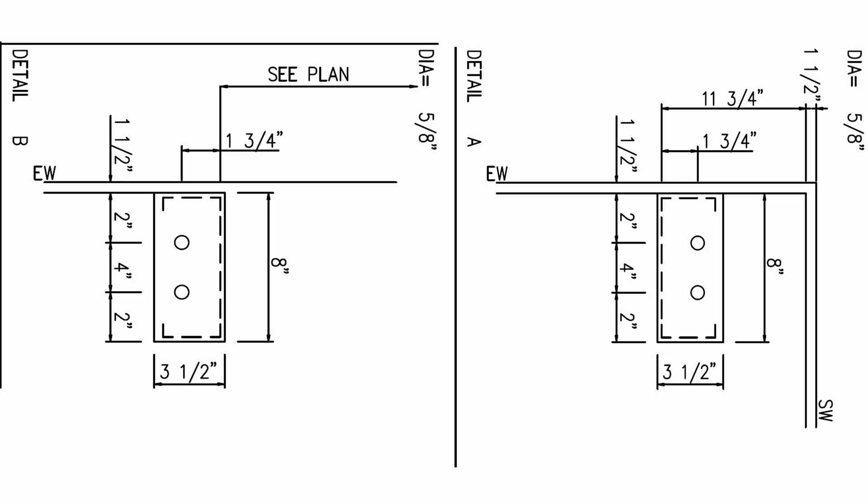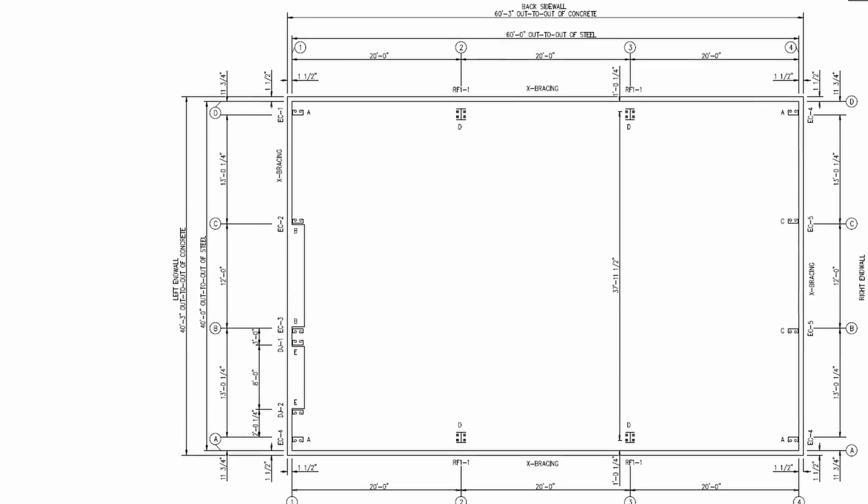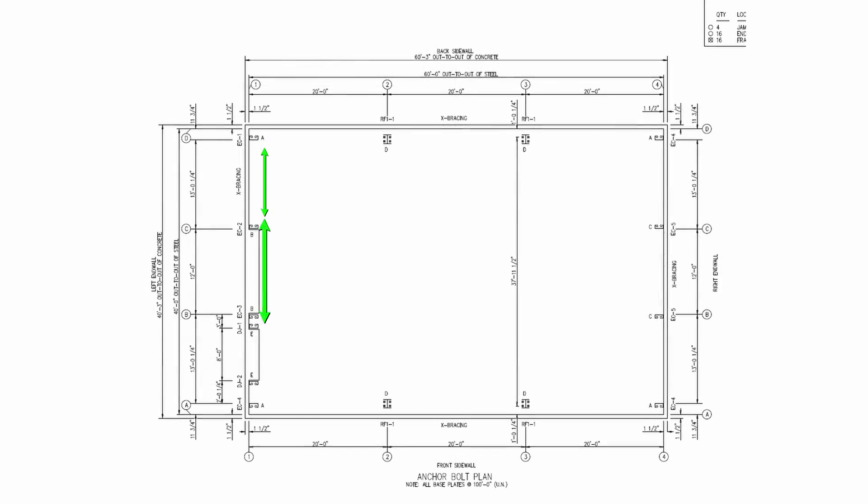C-channels either face inwards or outwards — we call it toeing in or toeing out — and the bolts are generally one and three-quarters inches from the web, the tall part of the C. Knowing the slab was the correct width, this measurement was easy. We still cross-checked from the other sidewall and did it on the opposite end wall as well. If the end wall's length is not within tolerance — say it's 40 foot 2 inches or 40 foot 1 inch — check the measurements between each column or each set of bolts. If the wall is out of tolerance, the method is to check dimensions between the patterns or bolts and decide on corrective action. This is some tough math, so if you wind up in this situation, give us a call.